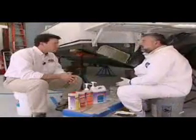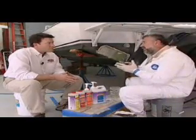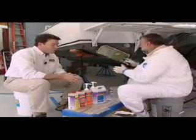Now, with your resin, are you limited by how many layers? I mean, if you have multiple layers, there's going to be more heat. No, John, we've controlled the exotherm of the resin system so that it won't boil. However, you need to be careful because if it gets really warm outside, if we're working at 90 degrees and above, you're going to want to work with the slower hardener so that it doesn't get too hot and go off too quickly for you.